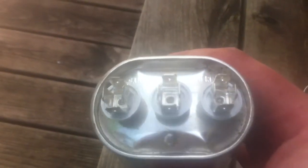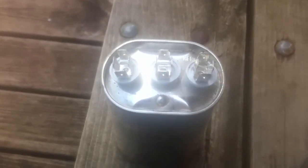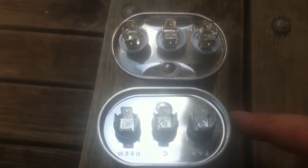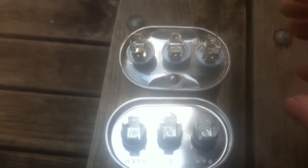You can see the different arrays to hook it up to. Something to look for on a busted capacitor is for something to be bulging out on it. So that is the old one I removed, here is a brand new one. And you can see the bulging here, all around the top, how it's bulged out. If you look at it from the side you can kind of see how the connectors have this arch to it. The new one, they're all straight across.